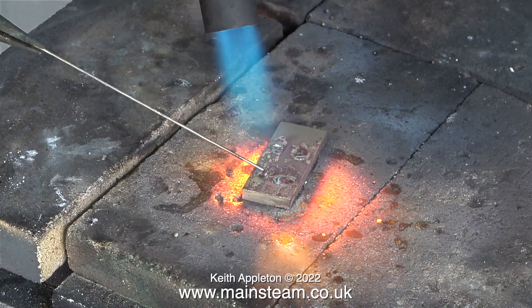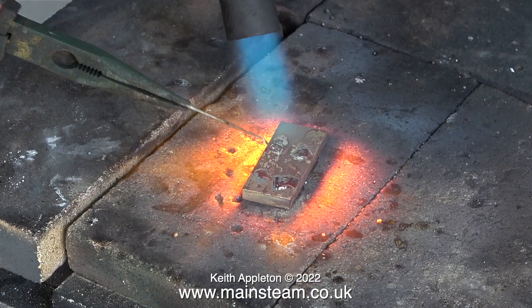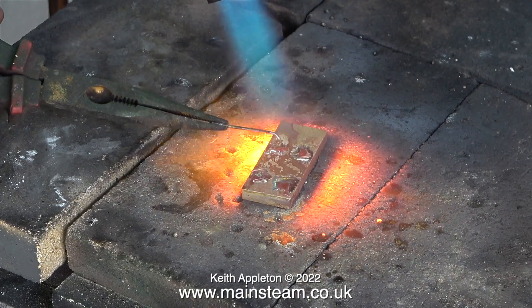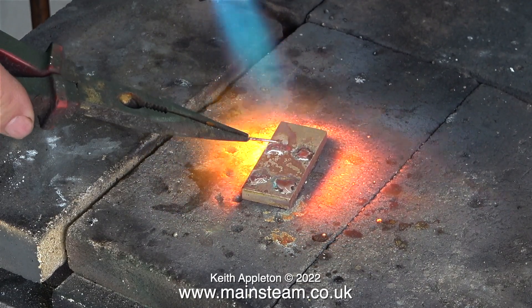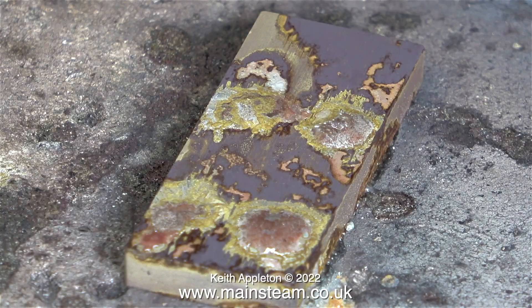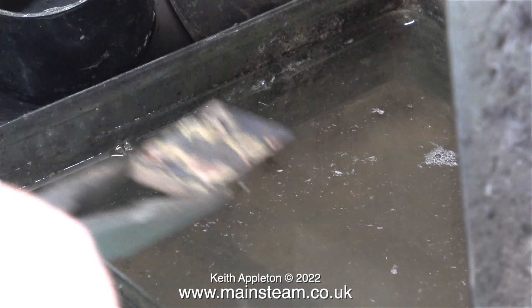The silver solder immediately flows into the holes and fills them up. After a few applications of the silver solder — which is now getting a bit too close to the heat, so I'm holding the rod with a pair of pliers — the brass bar is starting to glow red. Here's a shot of the piece of brass cooling. It's going to need quenching just to remove some of the scale, but you do need to let the part cool first. If you put the piece of brass into cold water when the silver solder is still runny, it will make a mess of it.